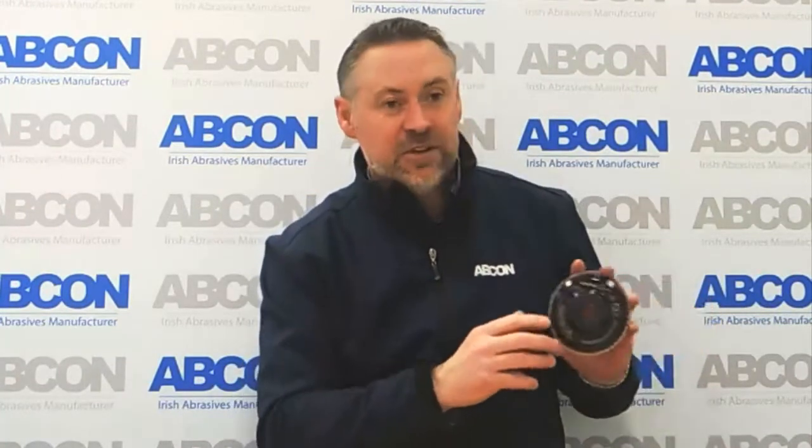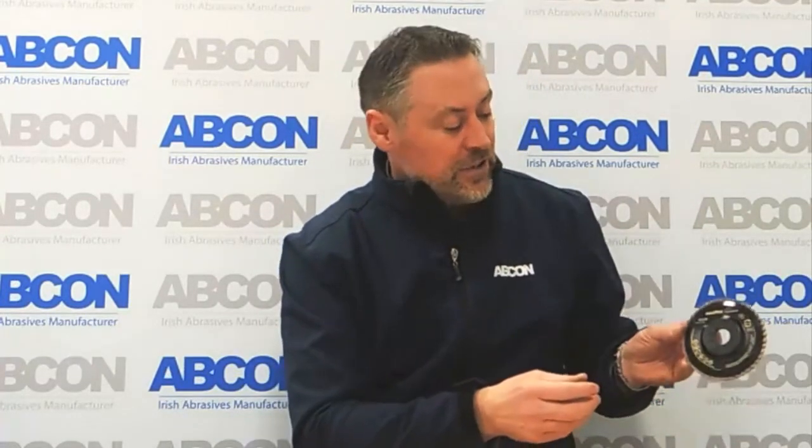The back is an eco-friendly composite backing pad. What makes this unique is that it is totally trimmable. That means that the back will wear away if you're doing corner or angle grinding. Also, if you wish to have a bit of flap overlapping to give cushion on your welds, you can trim the disc by putting it to a sharp bit of steel. There is up to probably 10mm trimmable on the backing.